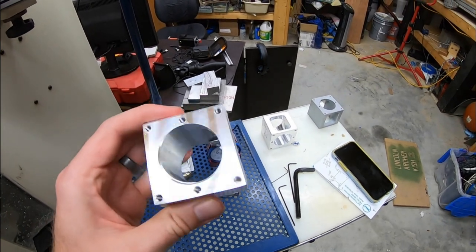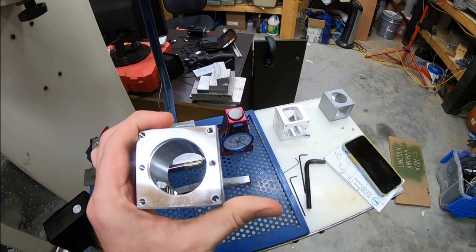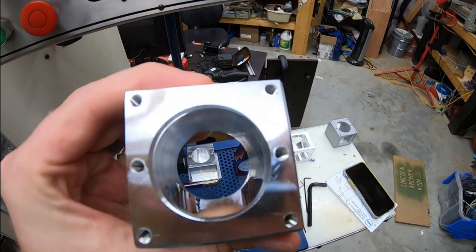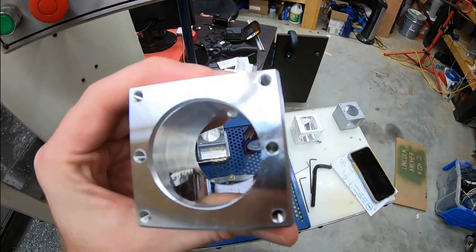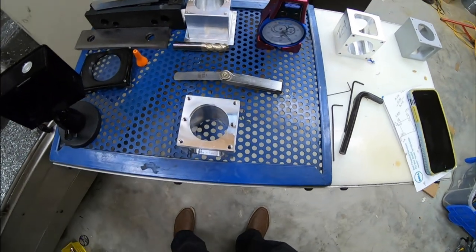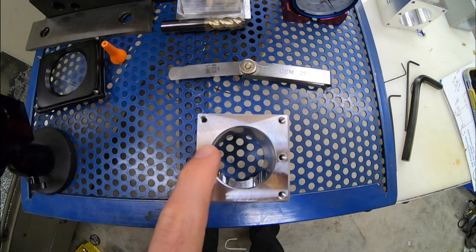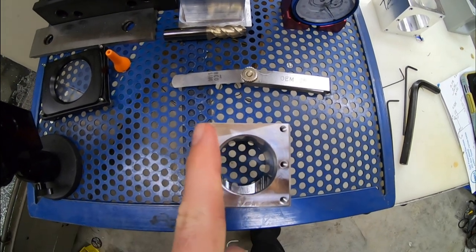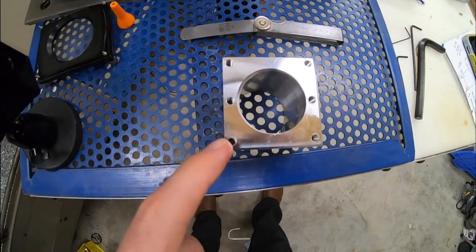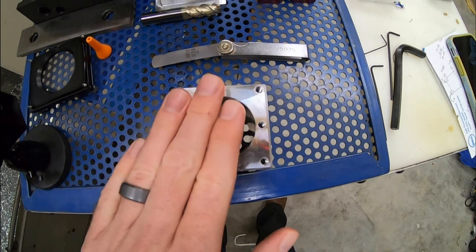I don't know if you guys can see it on the camera, and if you follow me on Instagram, you already have a preview of this, but you can see here the chamfer. I don't know if it's in focus with the GoPro, but the chamfer is lopsided. As you can see, it's way over here in this corner, heavy chamfer, and then no chamfer. And same with this circle. So this is the back side.